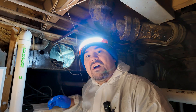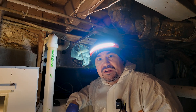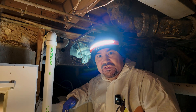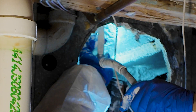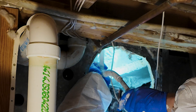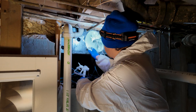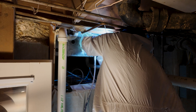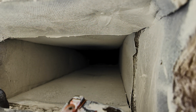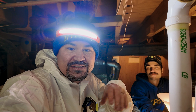Now I'm going to show you the process of how we get in here and start encapsulating. We're upfront about it — if it's fiberglass, it's going to get torn up during any cleaning process. It doesn't matter how you clean it; the fiberglass gets torn up when you use agitation. And you have to use agitation to dislodge debris embedded in the walls of the duct work. Now we're going to fix it. I've got about six feet right here — it's encapsulating really nicely. I can usually get six to eight foot increments at a time. Everything's white now. When the fibers are encapsulated, they can't break free, flow through the duct work, and land inside your house — you won't be breathing that anymore.